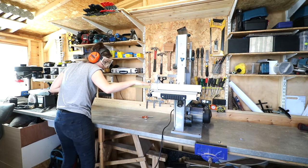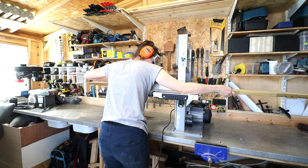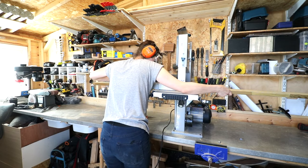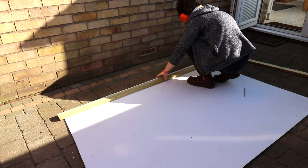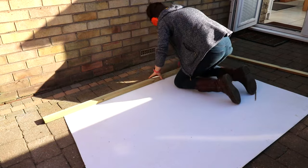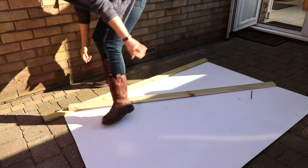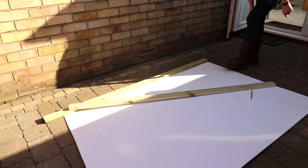Let's start with the side frames. Timber's not cheap right now so I ripped down two 1.8 meter lengths of decking in half on my bandsaw. The key thing that helps me here is having something square as a reference, like this sheet of ply lining, and I held my wood against the edges. I wanted the base to be quite wide, which is why the top of my second piece starts slightly lower. If you wanted, you could start right at the top instead.